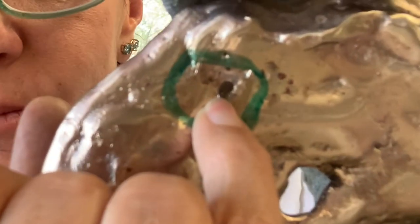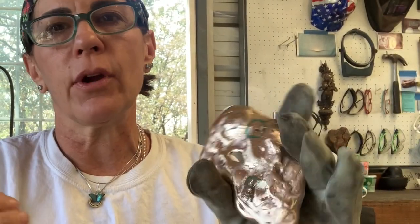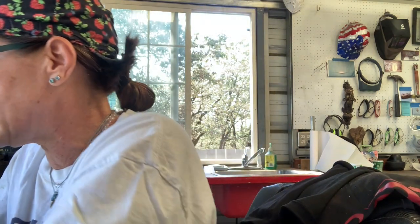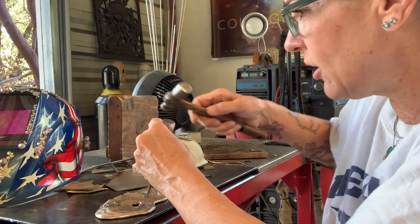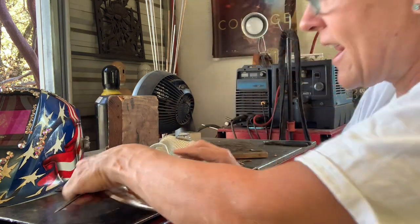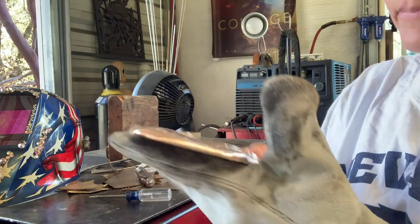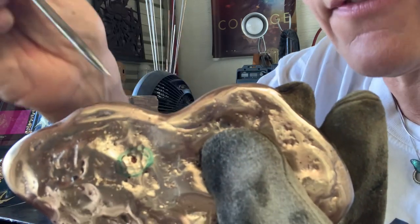So here is one right here — see that? There's another one right there, and it won't take patina or anything. You can polish it out but it usually shows a little bit pink, so I don't particularly like those in there. So I take a little hammer and I just bust it out. There's still a small piece left in there, but you just hammer right on it and it takes it out. This one is down inside a nook that the hammer isn't breaking free, so I'm just poking it and picking it out. Sometimes I can take my little pop and break it out — there we go. That thing is still hot, I gotta put my glove on. So there's just more of a divot and a hole right in there, and then you can wire wheel and repolish that.